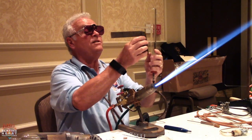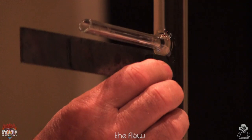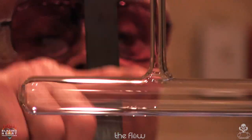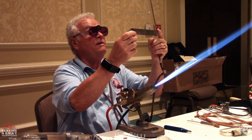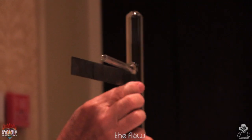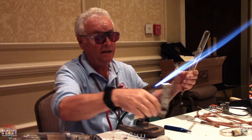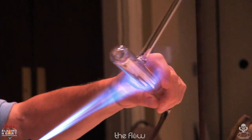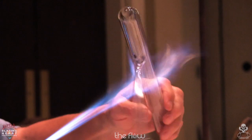All right, so I wanted to change my angle here slightly, just a hair. So if you have a nice flare on your seal where it flows right into the side, you couldn't get this up into that corner, the point. So you take the point off the square, now you can move right up in there. And of course, another tip is, this is cold, this is hot, so you want to make sure you don't break it. So I'm just going to warm this where I put that square, just so I don't get a fire check.